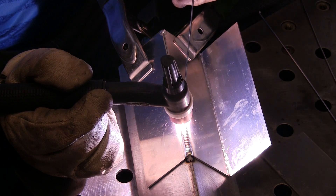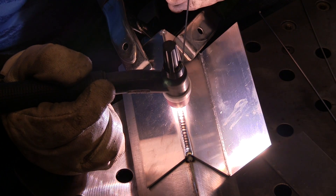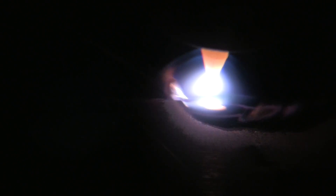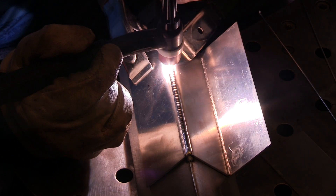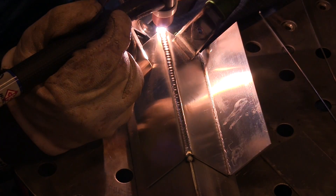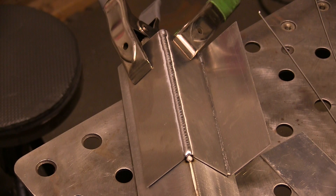You want those toes to melt the corners a little bit, because otherwise you won't get any penetration on the backside if you just run a cold bead. Sometimes on an outside corner the weld is finished off, and if you don't get any penetration you've got hardly anything there to work with — hardly anything left after it's sanded off. So you want some penetration, and you also want just a little bit of height to the bead. Let the puddle wrap around those corners a little bit — that's probably around 80 to 90 amps.